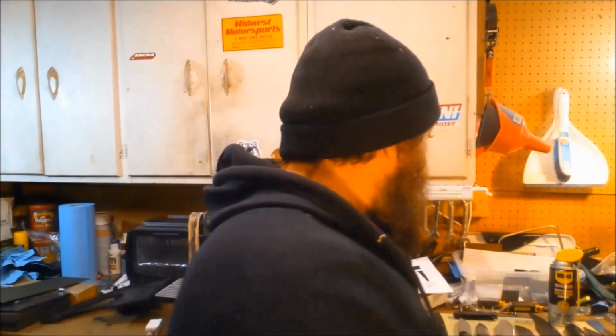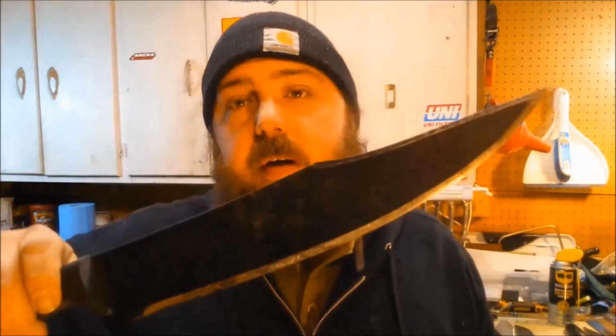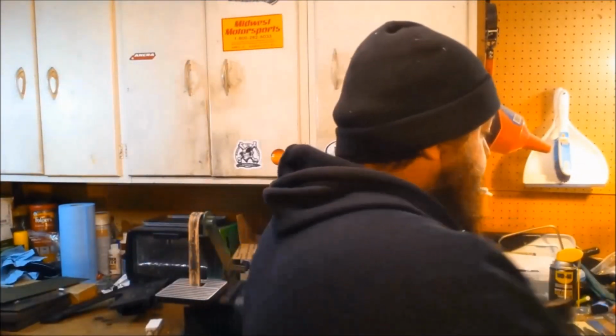As far as carbon steels go, there are the higher end O1, D2, and all kinds of different carbon steels, but I'm going to talk about the most typical ones that people like me and most of my viewers would buy. Start off with 1055. Cold Steel uses 1055 on everything from their machetes to their regular knives to their axes. 1055 carbon steel is a pretty decent steel.